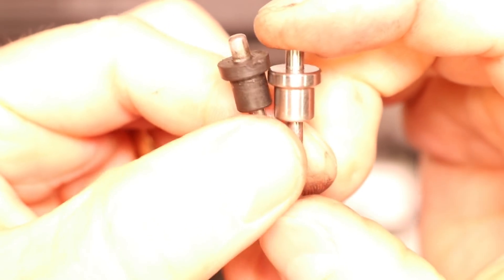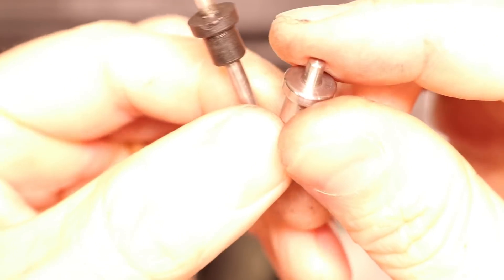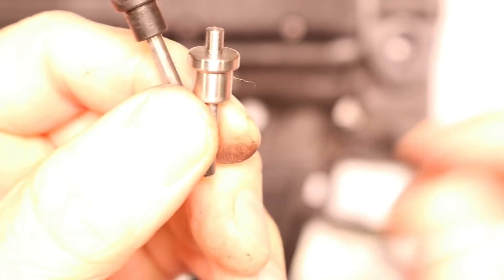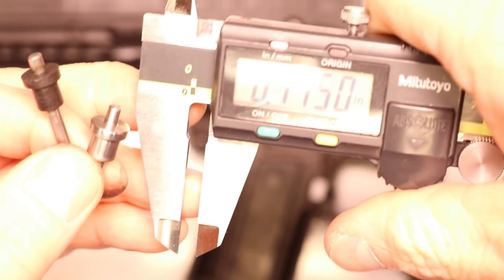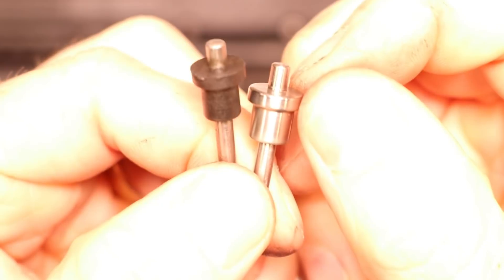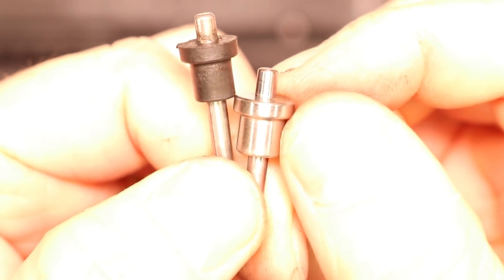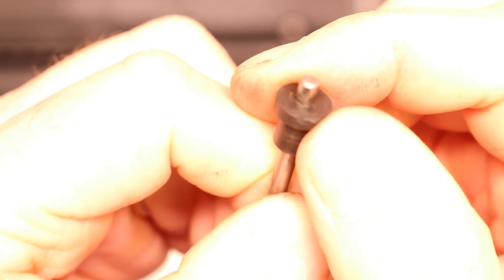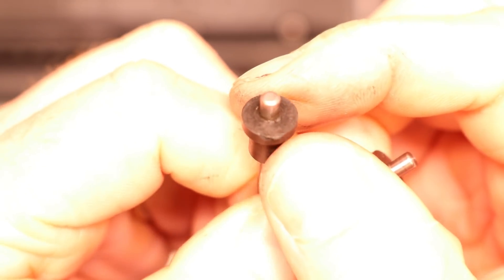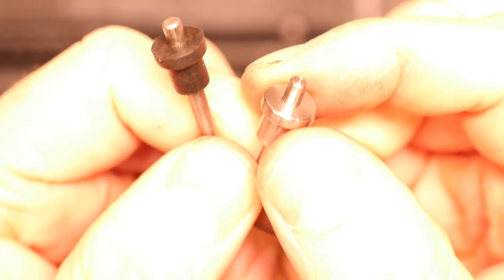Now when you look at what we've done here, we've got a 300-series stainless steel hammer bushing with a pressed-in dowel pin. This part is all machined, so your 175 thousandths standoff has already been machined in. It's absolutely perfect — you don't need to worry about that bushing moving around. Plus we put a bunch of little radiuses on the edges so it'll be more friendly with the internal operation. You can see sharp edges on the plastic which tend to create burrs and problems. You want that trigger bar to function smoothly on this pin — you don't want it to get hung up.